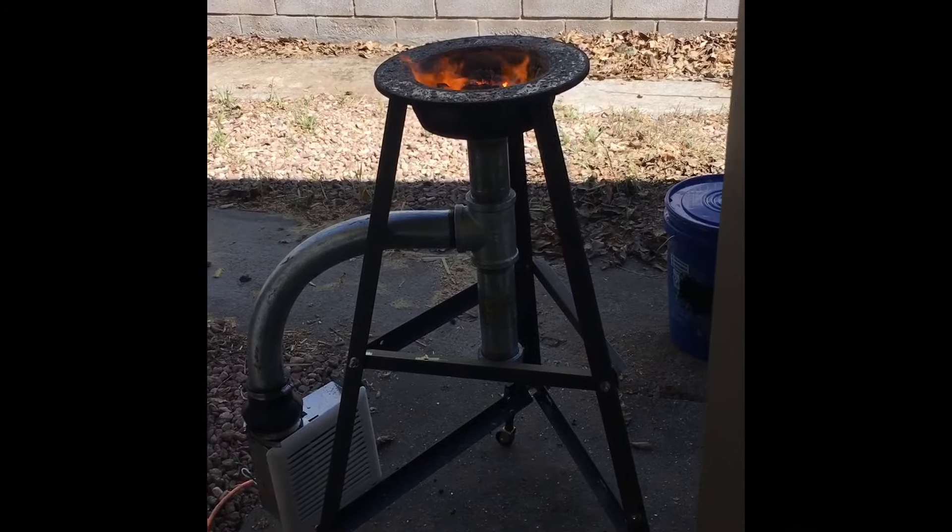All right, gang, that was kind of cool. We took a $5 bed frame, an old rotor, and some piping and turned it into our own forge. Now we're going to be able to make some other cool stuff. It didn't end up too bad - I got a malformed wrench out of the deal. I only hit it a couple of times, just kind of to see how effective it was going to be. There's probably some tweaking I'd want to do - I feel like the pot itself is not big enough, so I think I'm going to put something around it to hold more charcoal. I'm also going to need some sort of a stock stand because the wrench was wanting to teeter out just setting it on the lip. But that was fun. Go ahead and subscribe, like, tell your friends, and let's keep knowing some stuff.